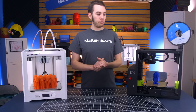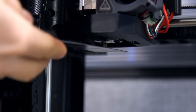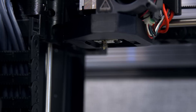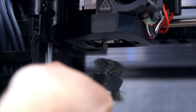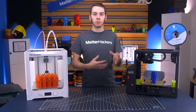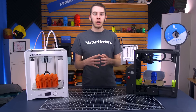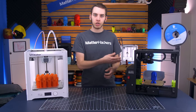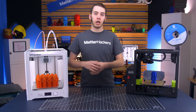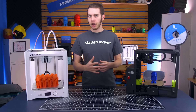If it's still not working, you can take either a spatula and rub the tip of the nozzle just enough to wear off any gunk that may have burned onto it. Or you can use a wire brush to very delicately clean the nozzle as well, being careful not to be too aggressive. What can happen is you can spark between the various wires going into the hot end, like the heater cartridge or the thermistor. I have brushed a nozzle and seen sparks before — no long-term problems, but you just want to be careful with the wire brush.